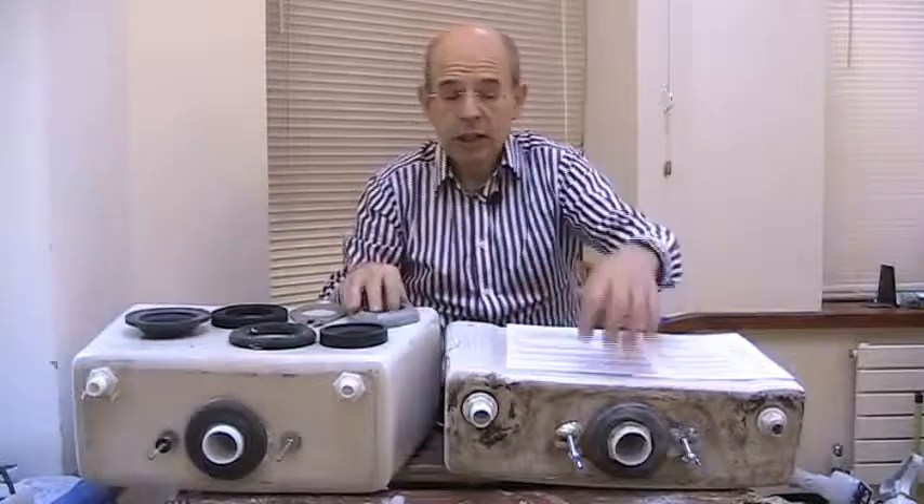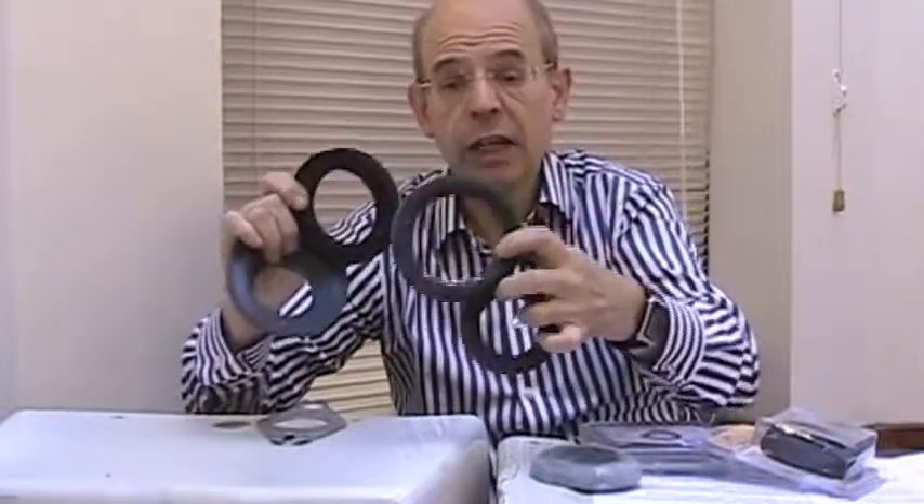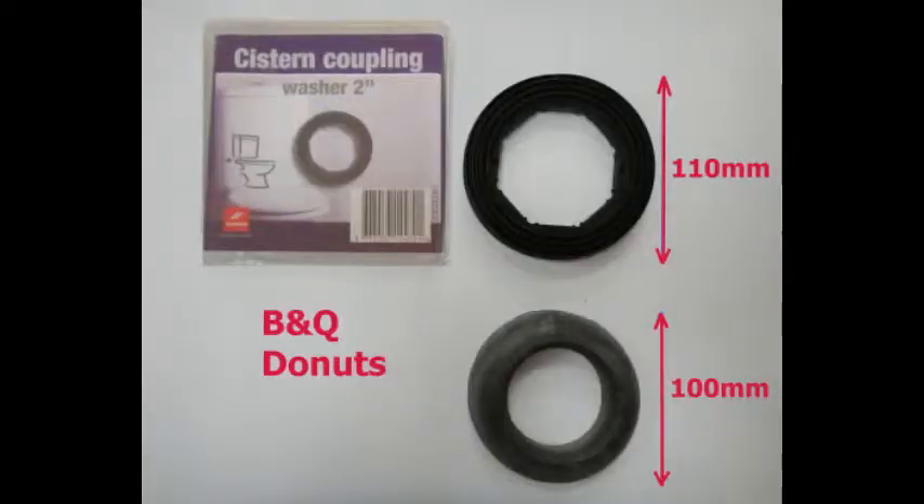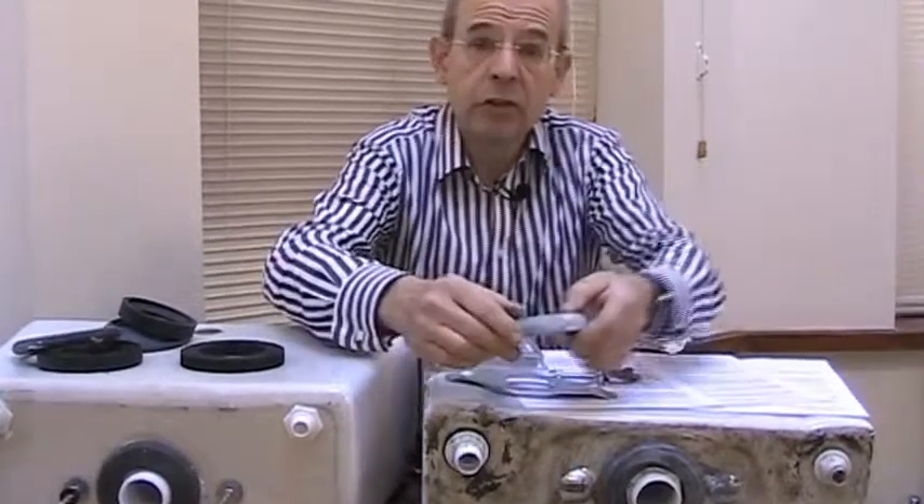If you want to get a new doughnut, that's a kind of traditional kind. If you go to B&Q they have two kinds: one is this traditional sort, but as you see from this collection here there are different kinds of different shapes of doughnuts you can get. B&Q also do one which is a bit bigger and would be able to replace bigger doughnuts. Although some are a bit more of a specialised shape — if you can't reuse these you might need to go to a plumber's merchant. If you've got rusty wing nuts you've very likely got everything else rusty as well, including the close coupling plate. The answer to that is to buy a kit — it's called a close coupling kit — which gives you plate, wing nuts and a doughnut all in one package, and you'll need all of this.